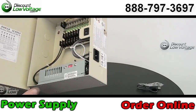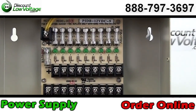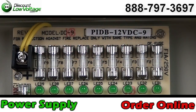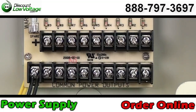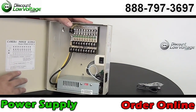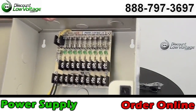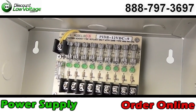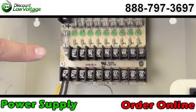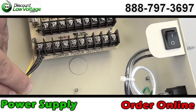Now, as we open it up, inside of it, you've got your fuses there. In case there's ever a power surge or a power issue at your job site or at your residential installation, one of the fuses will pop or go out. You'll have to replace it instead of possibly replacing your security camera. That's a nice little feature. And we got the screw terminals there. You got your positive and you got your negative here. You can tell the negative right underneath the wire there.